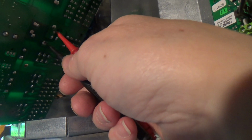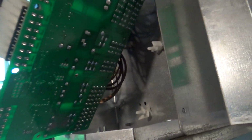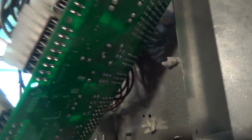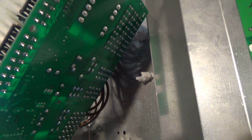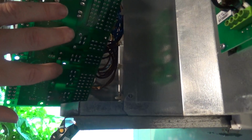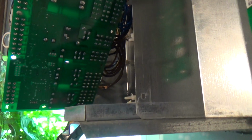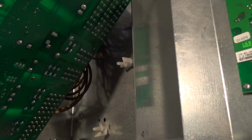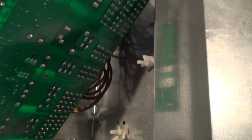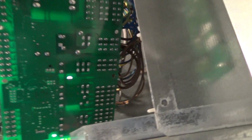Okay, that's the two pins for that relay. They're stuck together. So unless it's going through the live wire, that should just go to the compressor. Shouldn't go anywhere else for it to be looped on the other side of the relay. So that is pointing to that. Sometimes you have to be careful, because if you move the board, sometimes they're stuck but not that tightly, and jiggling it about is enough to open that up again. I'd usually give them a tap with a screwdriver just to see if they unstick, and it kind of confirms it's that relay. But anyway, we've checked that.